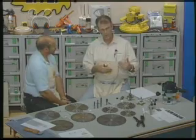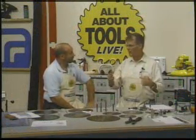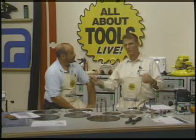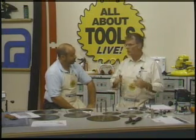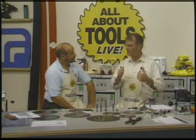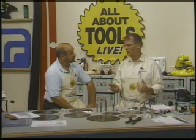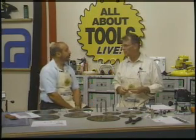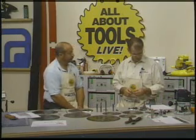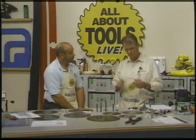Whereas some cheaper carbides will have a very short A period of cutting. It'll go rapidly into B, a little bit more of C, and then you just run it to D and you throw it out. Okay. So what you want is it's the length of consistent quality cut that you're after. How much of that will it deliver? And you need to pay attention to that, because that's really the time when you need to get the bit sharpened up. The most difficult bits are profile bits.